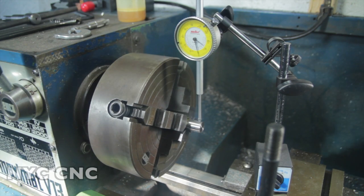So we're going to first drill with a 31/64. That's, I think, 484. Yep, 484. And then we'll go in with a 499 reamer. And then after that, I've got a couple of new interesting ways that we can polish and finish the inside of this die. We want this to be a mirrored finish. We want this to be smooth. We don't want the copper streaking or sticking.